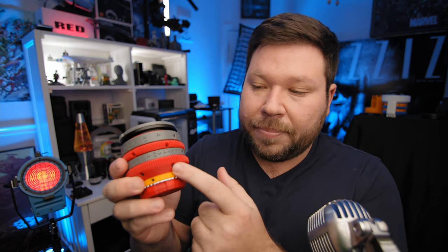As far as things you have to buy, you need these little nub screws, which essentially lock the 3D printed pieces onto the lens itself. By doing that, you will mark up the original lens inside. But that's all being covered by the lens housing. So if you don't plan on taking this housing off — especially since you can just reprint new pieces if things break — you're fine. But if you ever do want to undo the lens housing, the lens will still work, but you will have scratches from doing this modification.